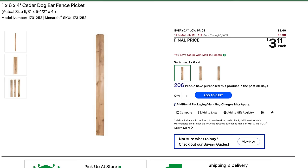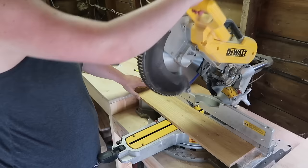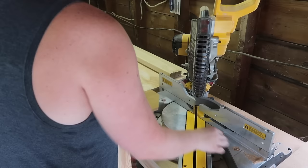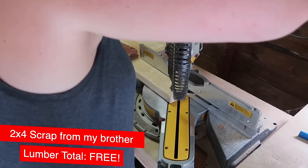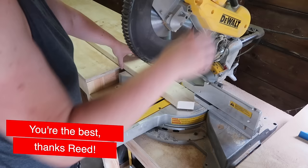For the rest of the video we're using variations of dog-ear fence pickets. I'm using one that is six inches wide by four feet tall, and trimming lengths of the wide planked board for gingerbread houses. I mark the center and cut 45-degree angles on either side to create a little house shape — you can use a miter box or a chop saw. I also did this with scrap two-by-four, cutting two 45-degree angles and making three different sizes of houses.